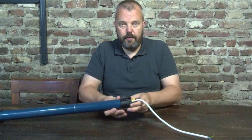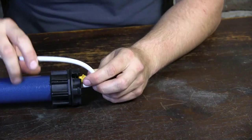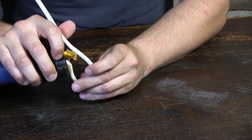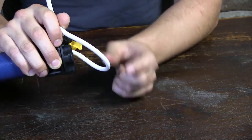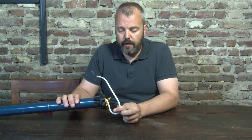The last tip: on the motor side you can see that the cable runs into the motor head, and often people choose the shortest cable possible and run it straight in. To prevent rain or water damage, make a small bend in the cable like so — because if water comes in, it will follow the path of least resistance and drip here instead of going straight into the motor head and damaging it. Any water damage is a reason for the manufacturer to void the warranty, so do make that small bend, especially when the motor is installed on the outside of your house.